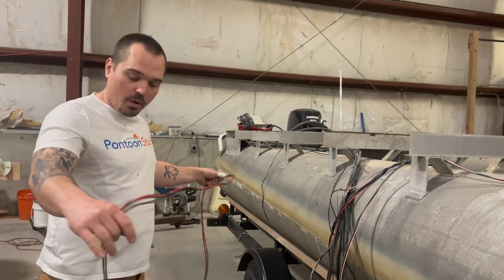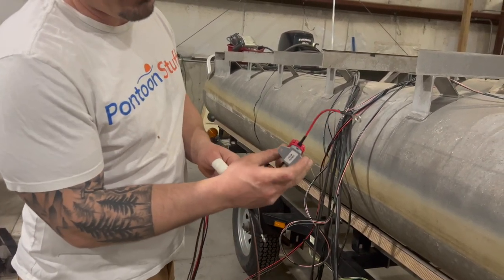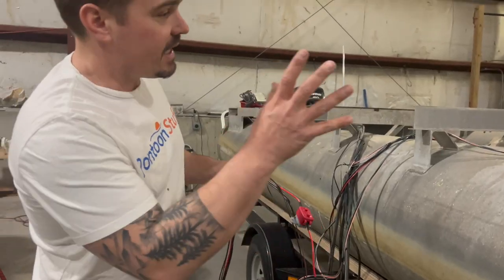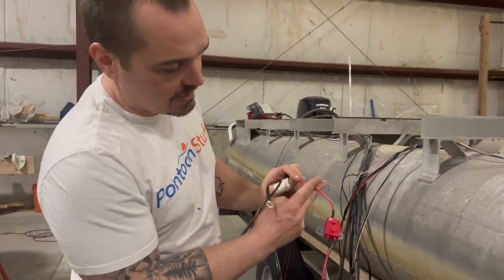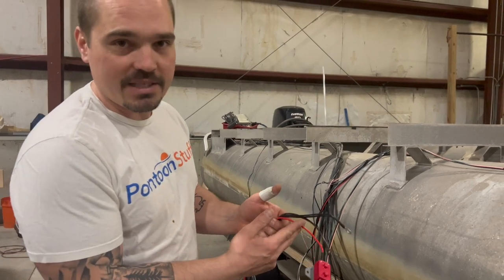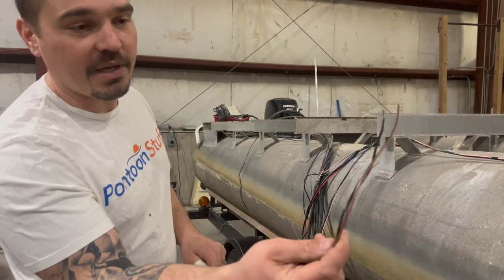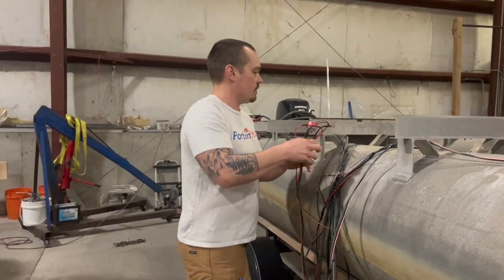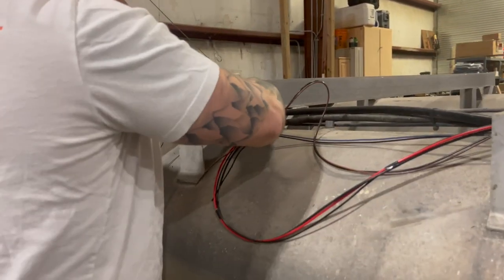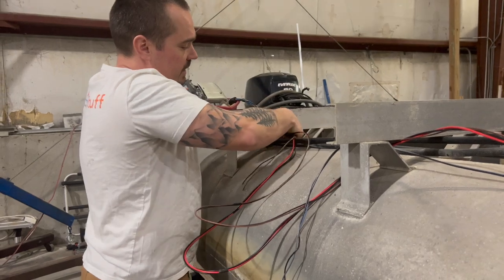I'm going to take the end of my wire to the rear. What you'll see on there is a resettable 20-amp fuse. So if your power ever quits, one quick place to check is if this little black button here is sticking out — you can push it and it resets. Occasionally, depending on your pontoon, you may have to snip this right here so you can run your wires through holes or underneath cross members, depending on what type of boat you have. Then you can just splice it back together before you install it and hook it to the battery. We're going to run all of these all the way to the back of the boat. If you're unsure exactly where they're going to end up or between which two cross members, I like to just get it roughly in the right spot and then adjust from there.